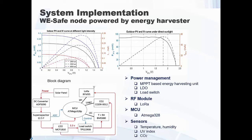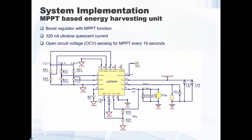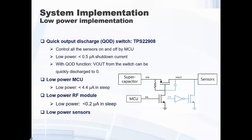This is the overall block diagram with all the power management. There is a commercial unit for MPPT — maximum power point tracking. If you are doing solar-based energy harvesting, high voltage doesn't mean high power; you need to implement an MPPT. This MPPT works based on a voltage ratio: based on the open-circuit voltage, there is some ratio that you convert to find the optimum operating point. We also implemented a switch to turn the sensors on and off to ensure the power from energy harvesting is sufficient for continuous monitoring.